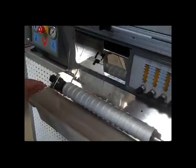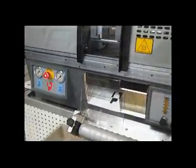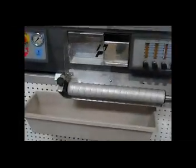As the parts and runner fall from the mold, the sprue separator allows the smaller parts through while keeping the sprue and runner on top of the ridged spindle. The rotating spindle then carries the sprue and runner to be dropped into a separate container.